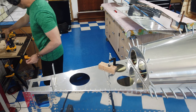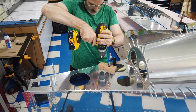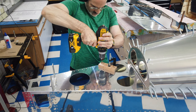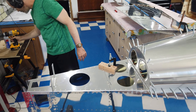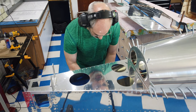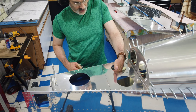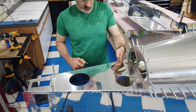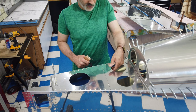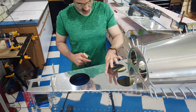I can take the drill bit out, put it back in my drill motor, and go ahead and drill that all the way through. And that is pretty much all there is to it. At this point you can take a mirror, stick it up underneath here, and you can see exactly where that hole comes out in relation to the support structure up inside here. These holes look really nice up underneath as far as edge distance on the longeron and edge distance on this angle piece.